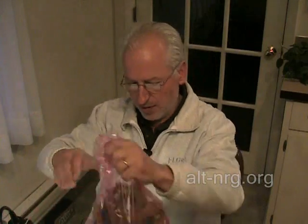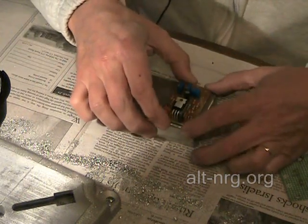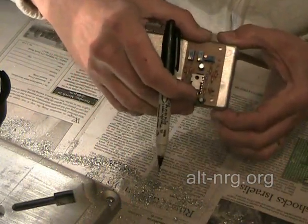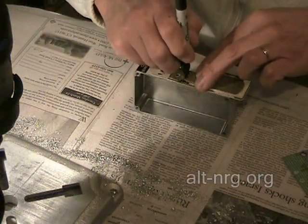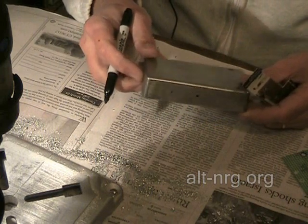The next step is to drill out the boxes and the heat sinks, tap the heat sinks, and put them together as a matched pair. Take a completed board, set it on top of the box, and use it to mark your hole locations in the metal before you drill. Hold the board as you make your marks with a fine point — there's the output, there's the negative terminal.